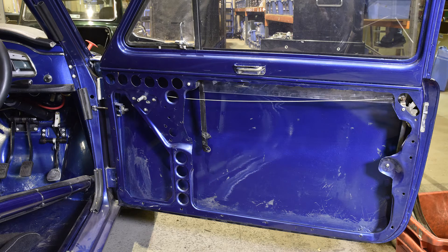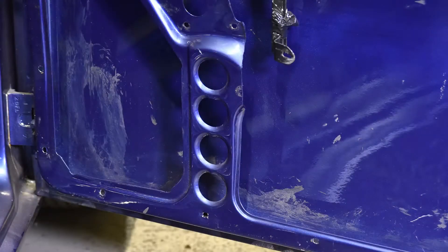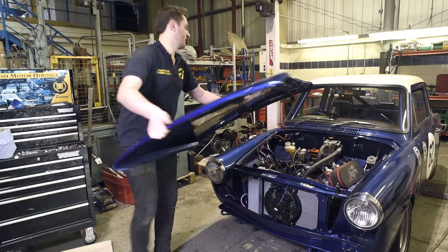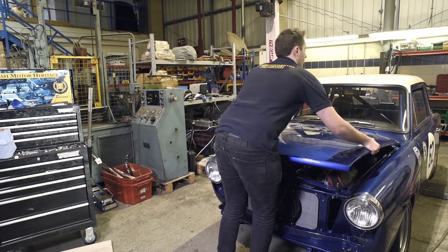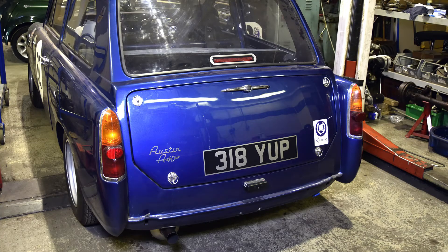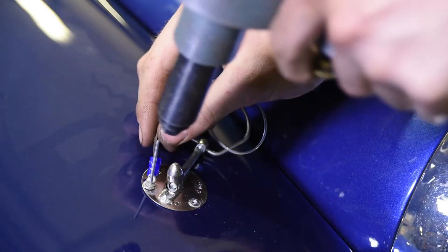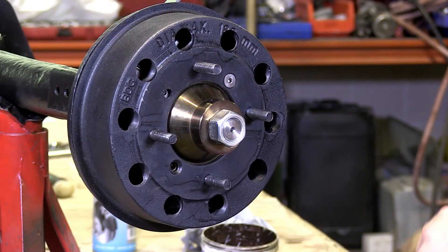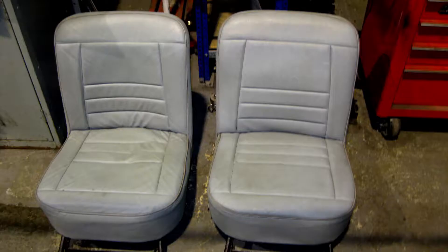As we've just added a load of weight, and there'll be more when we put the roll cage in, we have to look for places to remove some weight. For example, doors are always a favourite for shedding some metal as they're substantially not structural parts of the shell. The bonnet and boot lid normally have considerable strengthening frameworks, most of which we removed. In fact all that remains of the boot lid is a skin which, like the bonnet, is held in place with bonnet pins. Some component parts like brakes and seats will also be in for slimming treatment, but we'll consider them when we look more closely at those areas of the build.